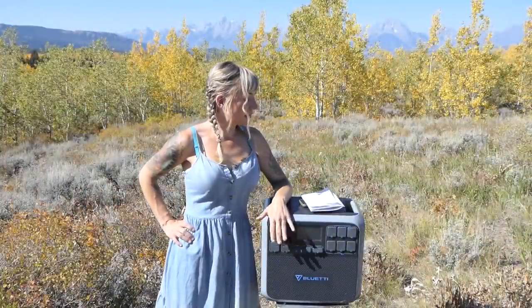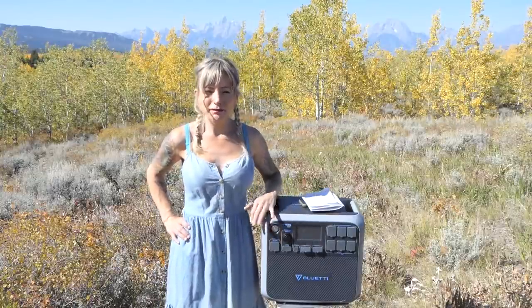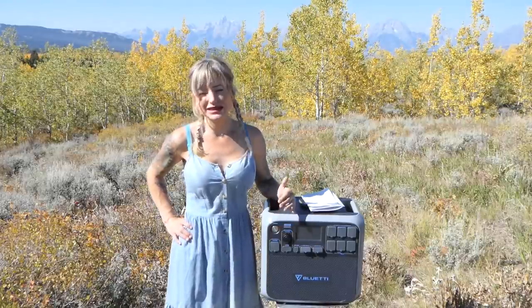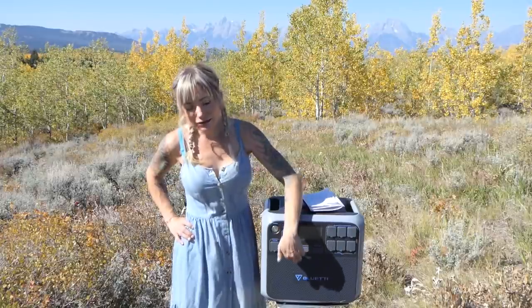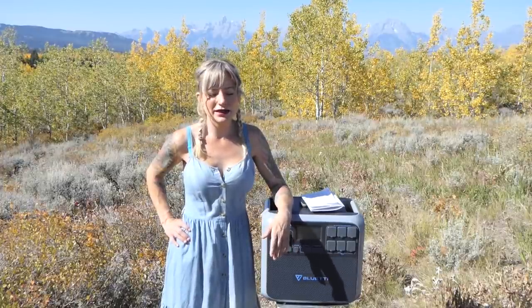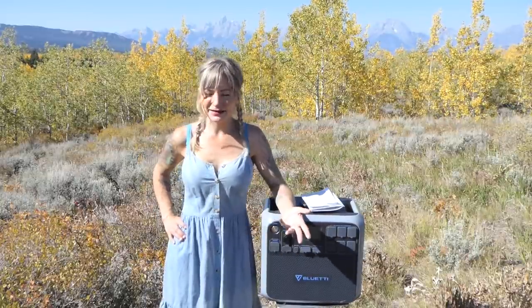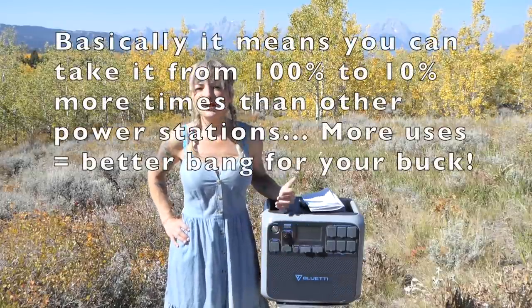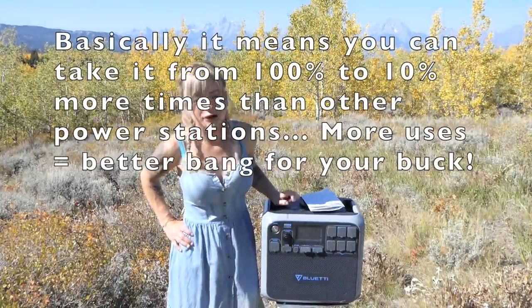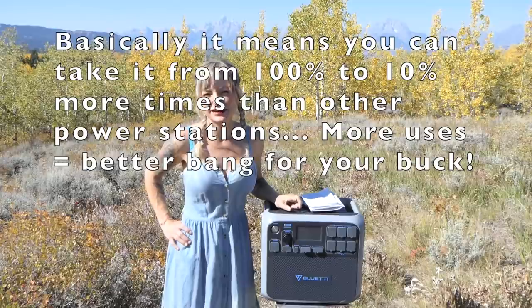What's really cool about this outdoor power station battery is it has the super large capacity and it has the premium LiFePO4 battery chemistry, which means you can also run it really low — down to what they say is about 10%. Below 10% you might start damaging the battery a little and you won't get as many cycles out of it. You're gonna get way more cycles out of the Bluetti AC 200P than you are from a product like Jackery that has inferior battery chemistry.